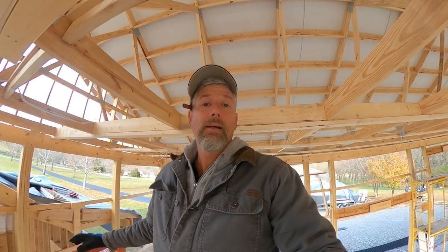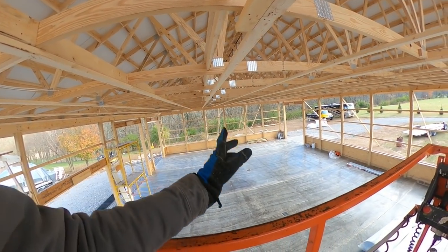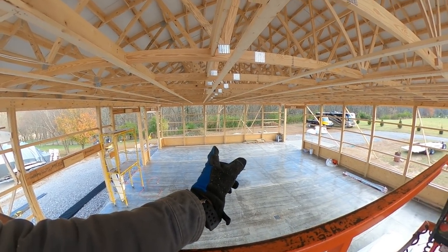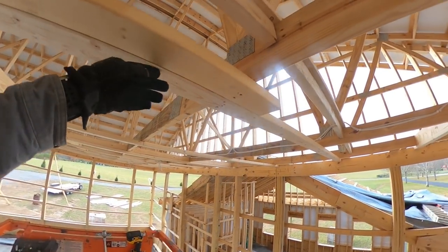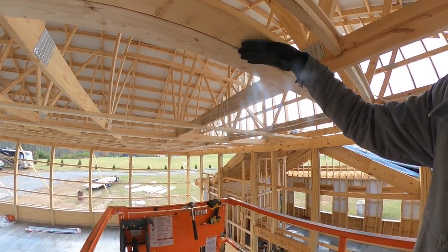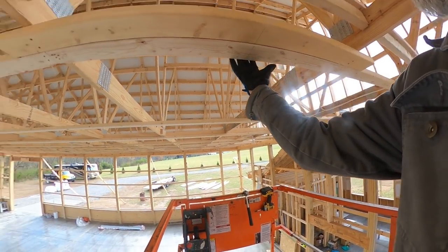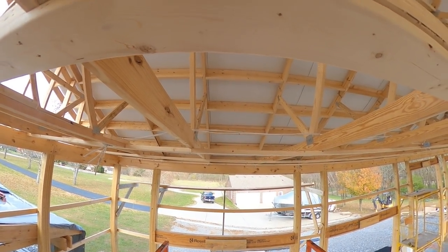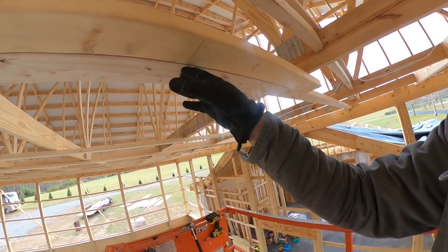Welcome to my life. All right, YouTube, so I've been putting boxes on for the garage openers down there. I used 2x10s for the three big doors. They're way offset. These ones line up pretty dang close to the actual purlins that are on the ceiling, so I just add another board to make sure you had plenty of room to hit something. And then I measured off to find center, transferred that to top, measured off that joist or truss, and then I ran that same measurement back here to find the center.